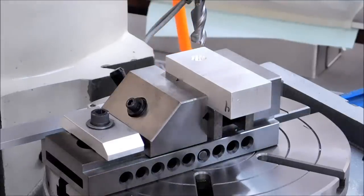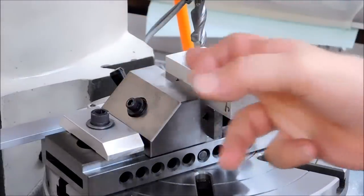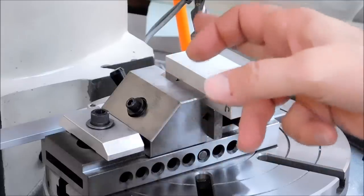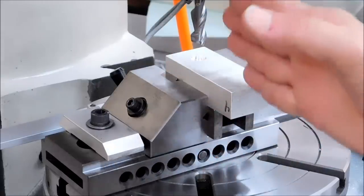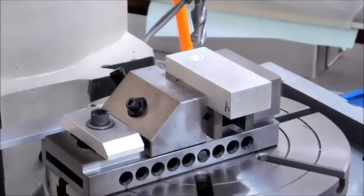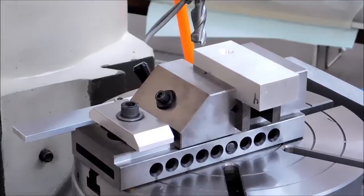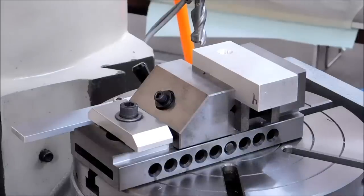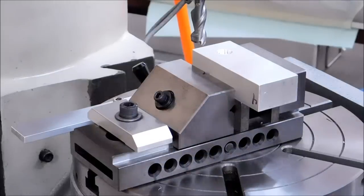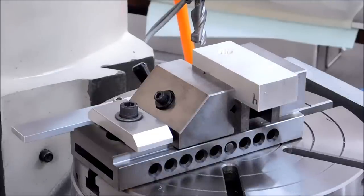Okay, mission accomplished. I like to climb cut, so I am going to begin my cut on this side. I'm going to move 750 because of the radius, and I'm going to take half the cutter, which is 250. So effectively, I'm moving my x-axis table 1 inch to the right. Now let's give it 10 for cleanup. So I am 1 inch 10th out from center on the X, the Y is still on zero.